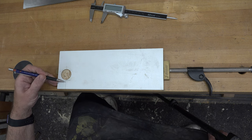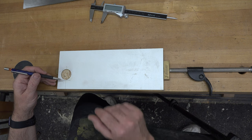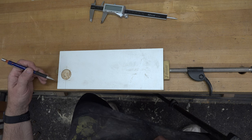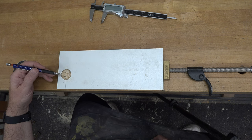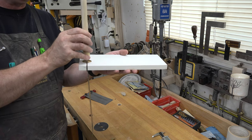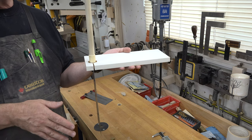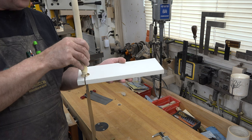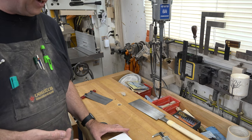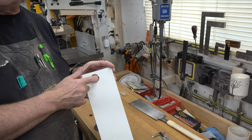Right along that one-inch line all the way to the back side of this circle I'm going to cut a one-eighth-inch wide kerf. You can do this on the band saw, use a hand saw, or even use the saw you're planning to place in there. For me, you guys know what I like - I'm going to use the scroll saw because it'll be quicker and easier. What you end up with is something like this: when it hangs on the wall your saw slides into that slot and the handle sits in that hole, keeping it from falling through and supporting it. That's one done. I have two saws like this, so I'll repeat the exact same process, checking dimensions and clearance against the holes and kerf we just cut.